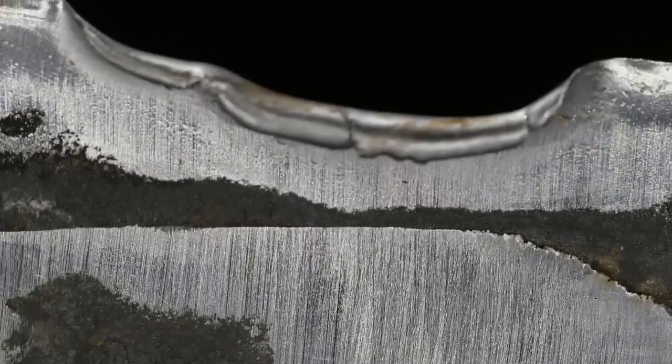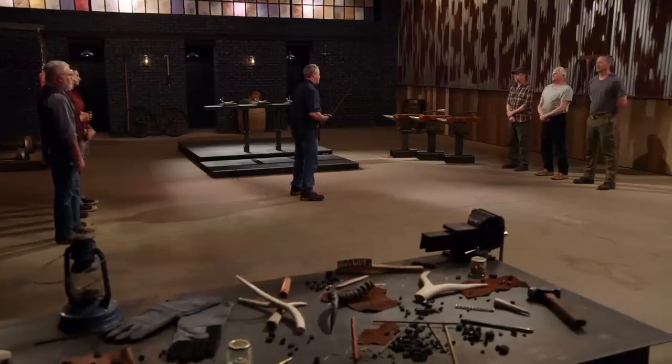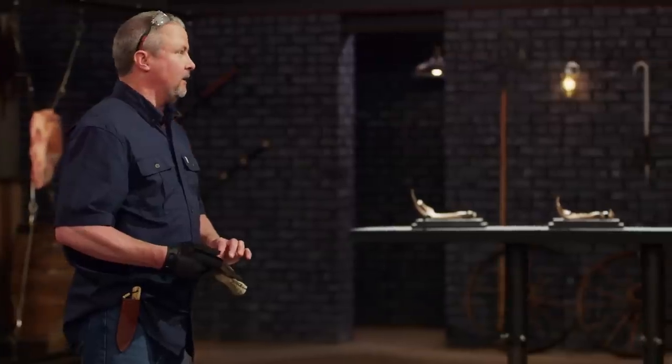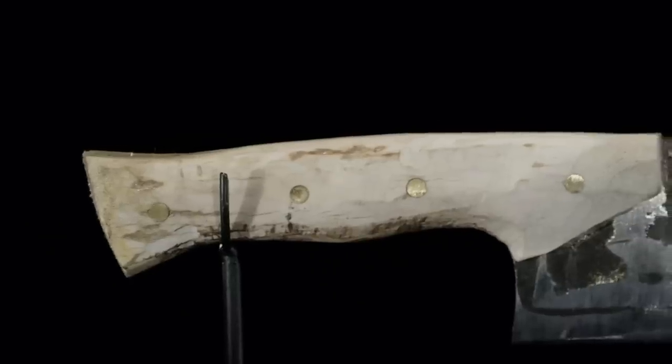All right, Trevor, we've got an issue. You've got quite an extreme roll here, and you can see right in the middle — in that roll it started to split as well. You had an issue before with your San Mai not being connected all the way. You can hear it — that's opened up more, and there's a spot down here too. Your handle is on the large side, but I like the way you contoured it. My hand just kind of locks into place, but the edge is definitely an issue.